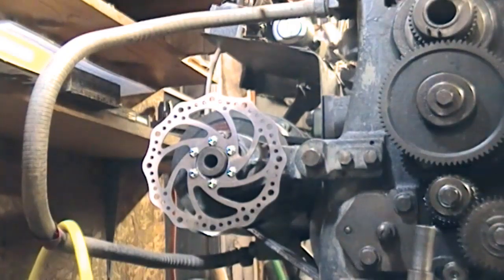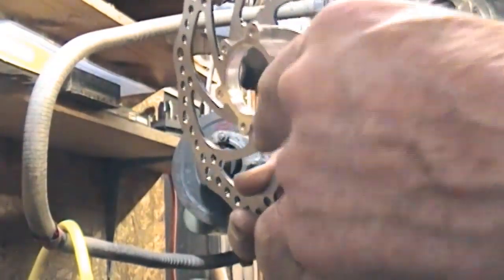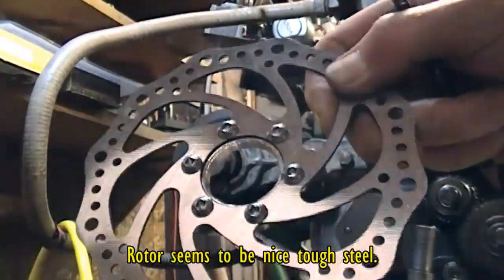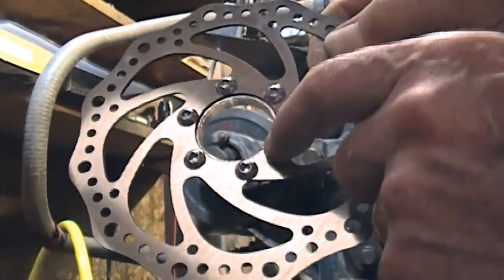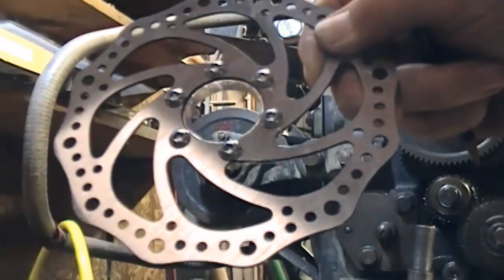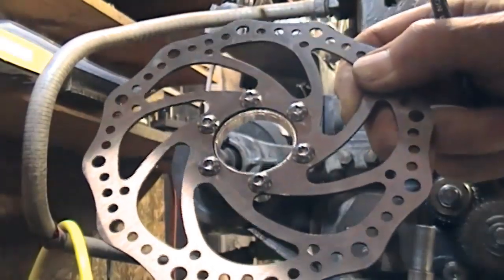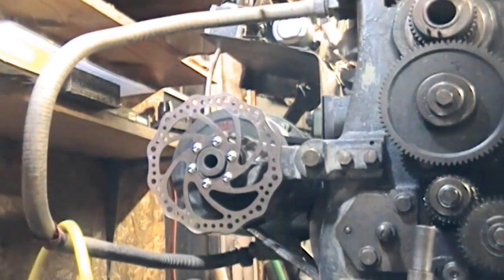This has got the aluminum boss which is threaded. It may be I can make a new boss for some purpose, or maybe take that off and just go straight — just mount the disc directly to the expanding arbor, possibly with a keyway or a pin or something. So there we are, that's the current plan. And as I've said before, sometimes watch this space when I get round to it. Thanks for watching.